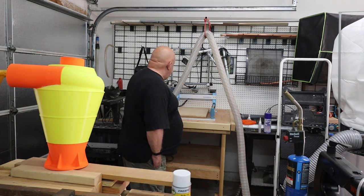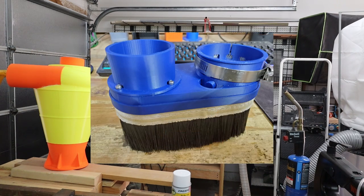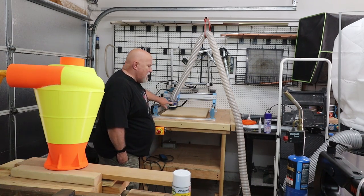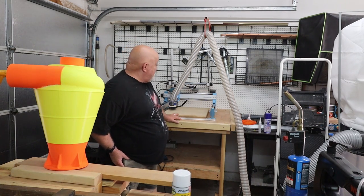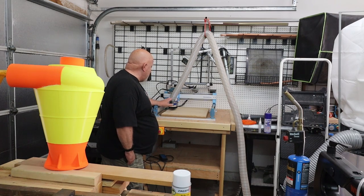The dust boot, once again, here's some pictures of the dust boot. I had seen one on Etsy, looked really cool. They wanted like $55 for it, printed out and shipped. I looked around some different websites, which I'll have the link to below in the description, and I found one on, I think it was Thingiverse, that was exactly the style that I wanted. It takes magnets to hold the bottom on. So I printed that, I hot glued in the brush down below. I trimmed down the bristles because they were way too long on what I currently had.